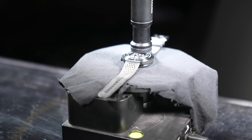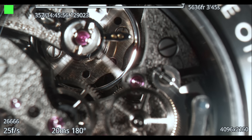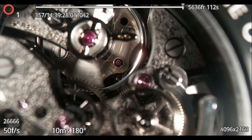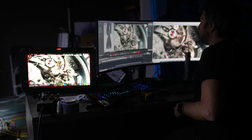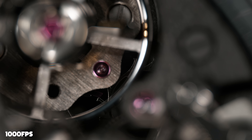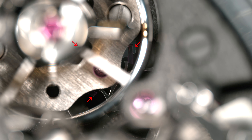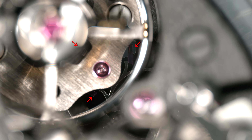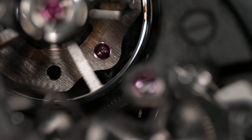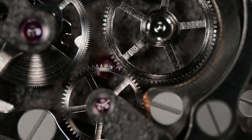The first area of the watch I'm going to look at is the escape wheel. It's very sunken down, but we can see it. I'm only at 25, so I need to up the speed — I'm going to open up the aperture on this probe and set the frame rate to 1000. Here at 1000, you can see that the escape wheel is actually starting and stopping very abruptly, and if I just brighten it up a little bit, you can see that the pallet fork and its jewels are catching each arm of the wheel like a ratchet. The other area I want to look at when we get the microscope on is where these wheels interact. This wheel on the right here seems to be directly connected to a wheel above it which we can't see, and that wheel looks like it's driving the seconds hand on the face of the watch.